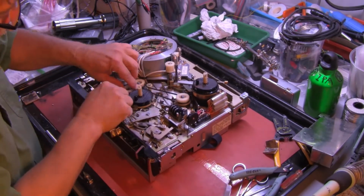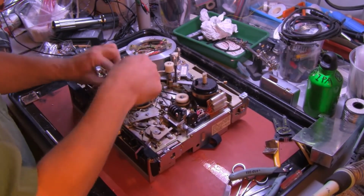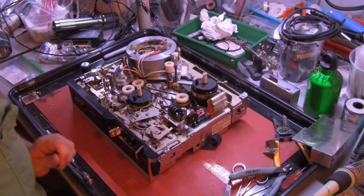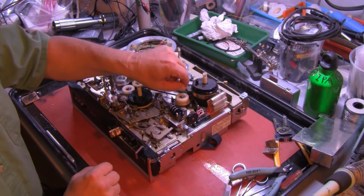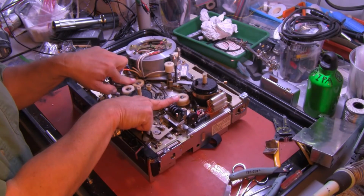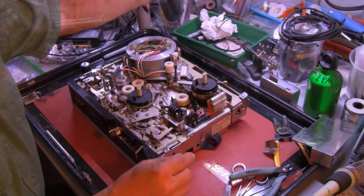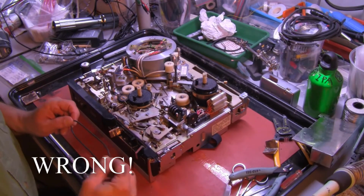This one is a tight squeeze to get it past the rubber idler roller. Just be aggressive, push it through. It will go and seat itself. There we go. That one has been replaced. It's a square belt. The next belt is a round belt. I call it idler number 2. It goes around 2 pulleys, here and here, and a 3rd idler pulley right here. Comes out. The replacement is RBS 9.0.